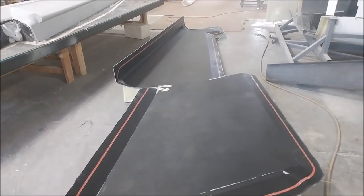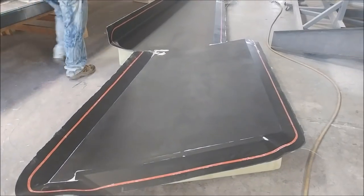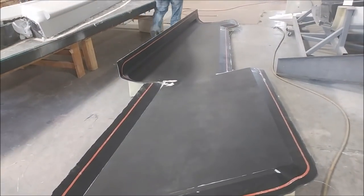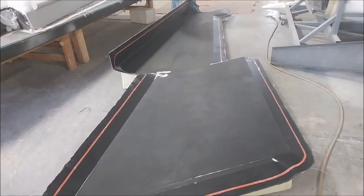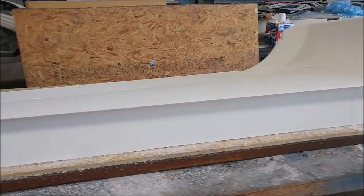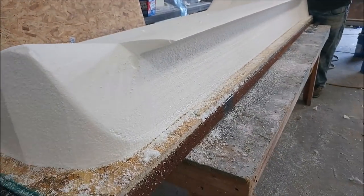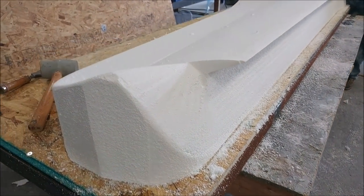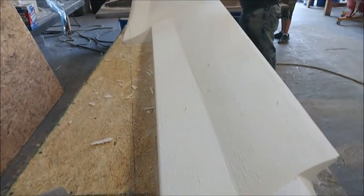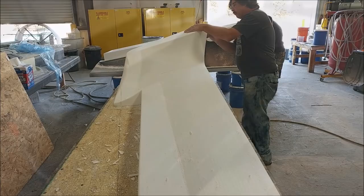Here's the last of the upper wing skin molds — it was just popped from its plug and came out nice. There's a little residual damage to the plug but nothing that isn't repairable, and the mold itself came out with no damage. Here's the piece off the mill now, with Jeff doing the last little preps and cleaning up around the edges so it'll be ready for glassing.